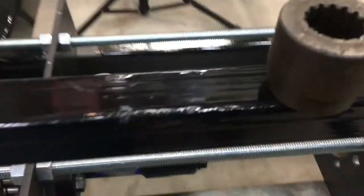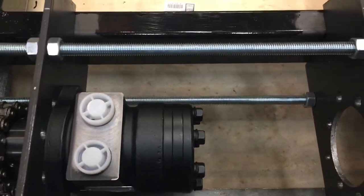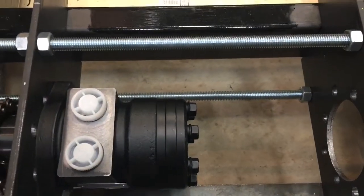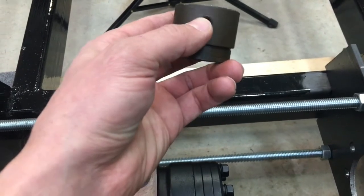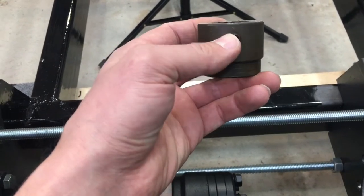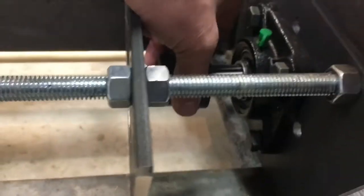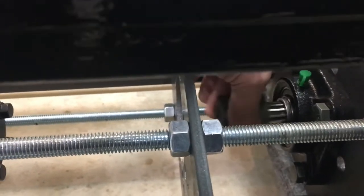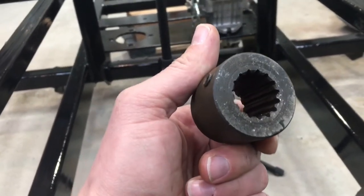If I do that on both sides, I should have a little bit more space between the motor and these bolts, and I should be able to maneuver both motors into place without any conflicts. So I'm going to take these spline hubs and just start to trim off some material. It's probably going to start to get into the set screw, but I'm not too worried — I wasn't really thinking of using that. Allowing these to float on the shaft would probably be a better idea, or worst case we can drill and tap a new set screw hole. That's Plan A.